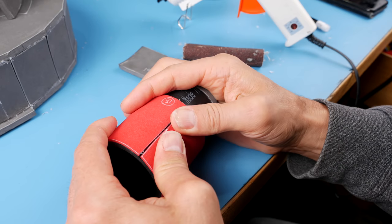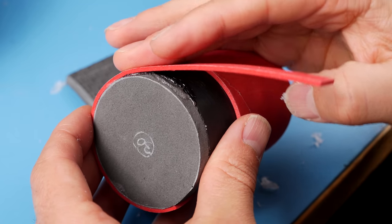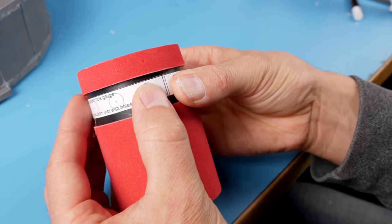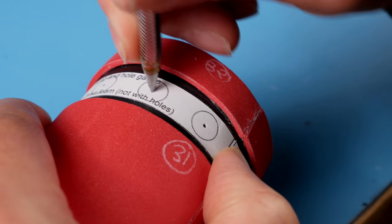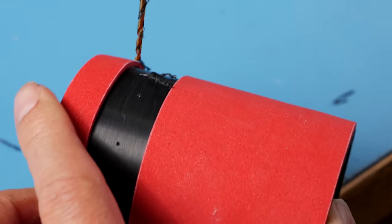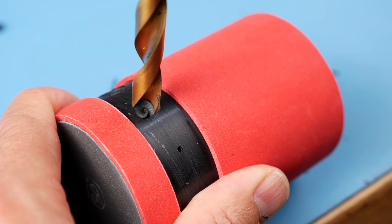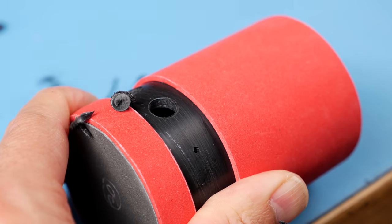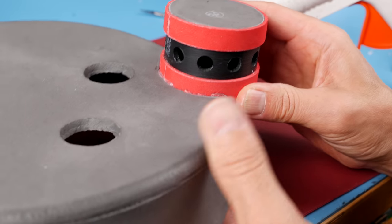Hopefully by the time you get all the way around, those two ends will line up perfectly. Do the same thing with strip 32 around the top. Wrap the pattern strip for piece 32 centered in the area of the pipe that's not covered with foam, and use a pointy tool to mark the center of each circle. Drill a small pilot hole on each mark and then carefully drill out all the holes with a 3/8 inch or 10 millimeter drill bit. This is the filter and it's going to get glued into the nice little cutout in the cyclotron pan.